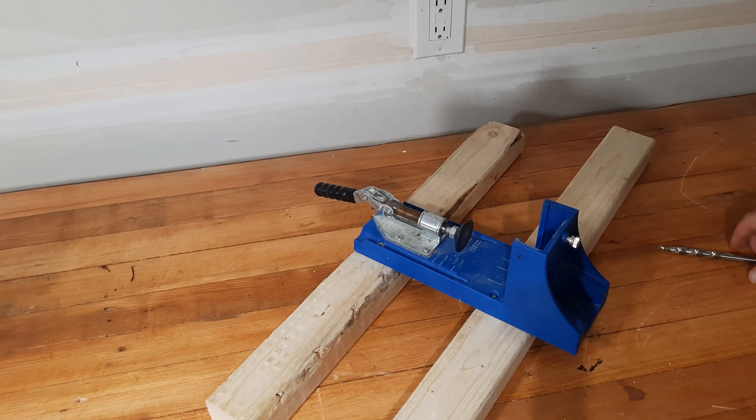Now that it's in the correct position to drill — if you do get this jig it can be a little bit confusing as to where the inch-and-a-half stop is meant to be. You just have to look at the other side, which actually has an inch-and-three-eighths mark over there. So obviously, inch and a half has to be further down the channel than inch and three eighths. Just make sure you've got it all the way down as far as it can go, and that'll ensure you drill your hole perfectly.